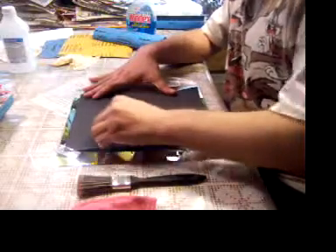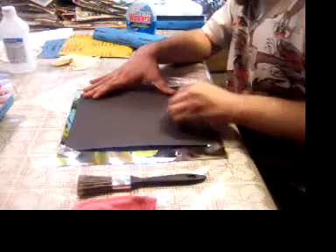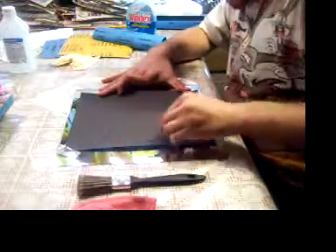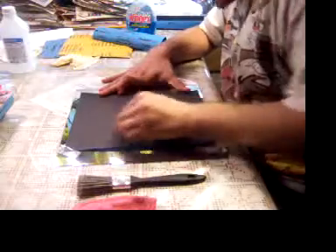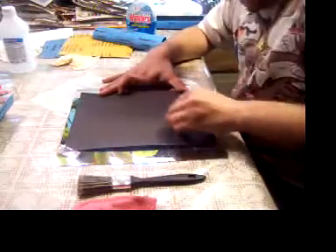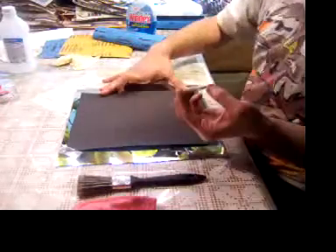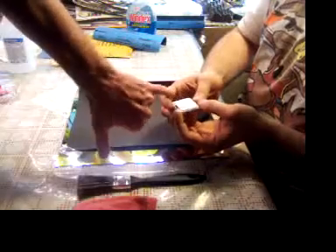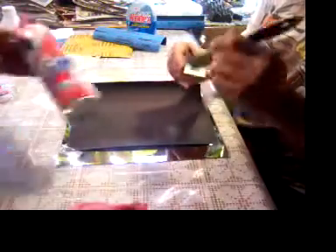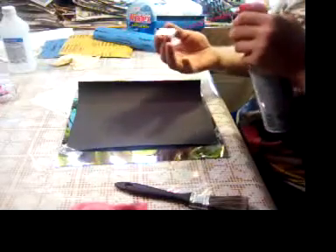Now it'll stay flat so he can use the entire sheet. Keep rotating — you don't need to count, just look for a crosshatch pattern. Notice the speed I'm going; the faster you go, the more polish we get. Periodically look at it — we're starting to bring out all the copper, just getting the very center. Use the can of air to dust the backside, then do the front side too. Periodically use the can of air to blow it off and make sure we don't get any debris.